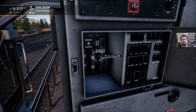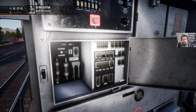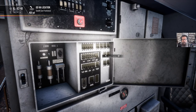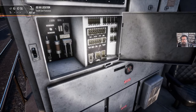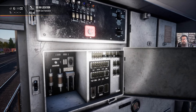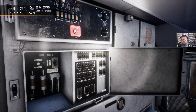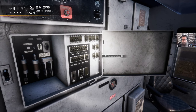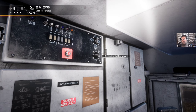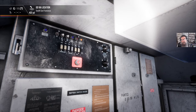That sets the brakes up. Now let's get ready to start up — we inspect our fuses, they're fine, and we turn on everything that's in the black section again. In here we do not need a radio. We can have our light switches on but we don't need headlights. The auto drain timer should be on because that's draining water out of the compressed air tanks. Utilities yes, warning devices no, and electronic devices no. We're in start and we are a single or intermediate unit, so we want controlled from another unit coupled at either end.